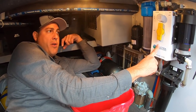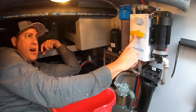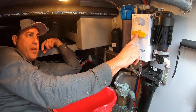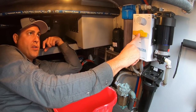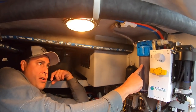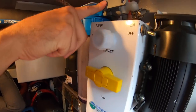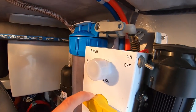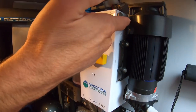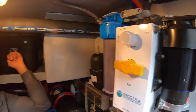We're not going to run it with seawater — we're going to do a freshwater flush. So I'm going to turn this yellow valve to off. When it's in off, the water needs to be delivered from a freshwater source. We have a freshwater holding tank and a freshwater pump, and that water is delivered through this charcoal filter. To get the water flow started, I just take this gray valve and turn it on. Now we have freshwater entering this yellow selector, and I just turn this switch on to start the water maker pumping.